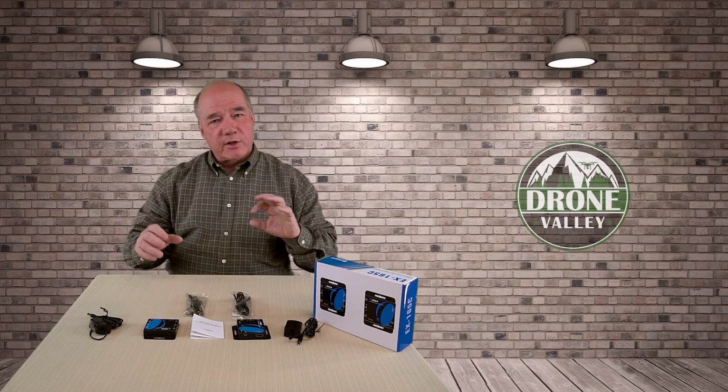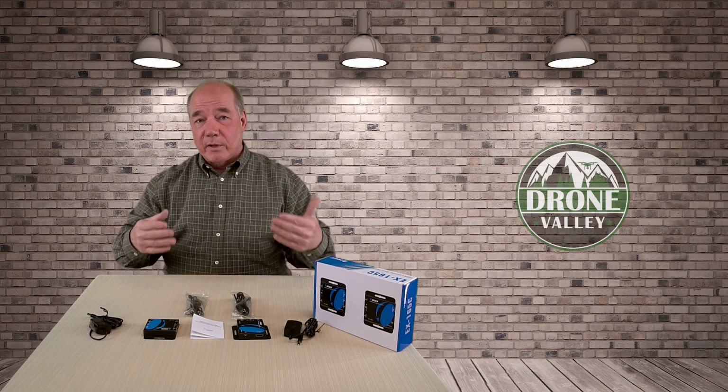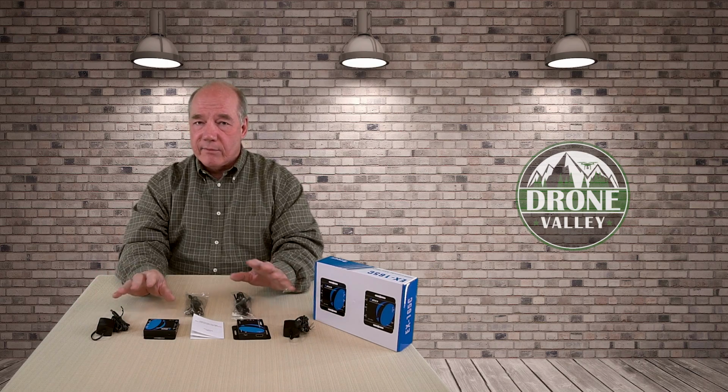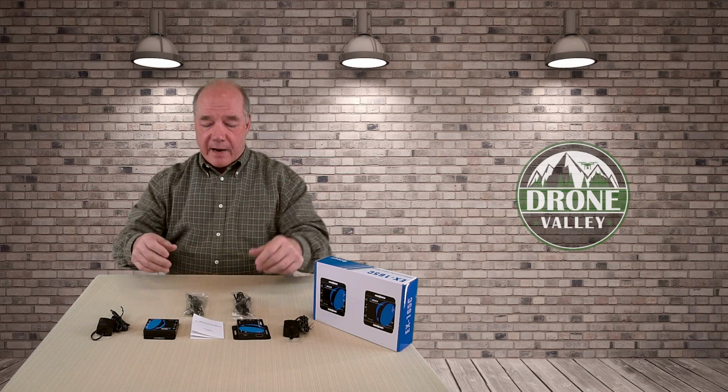You're going to have, again, spotty connections. You're going to have issues with it working maybe intermittently, depending on what's going on with that TV and what else is plugged into that outlet. So I love the fact that we have dedicated 5-volt power supplies that take care of that, and I have no issues whatsoever with these guys blinking out because there's not enough power to power them up.